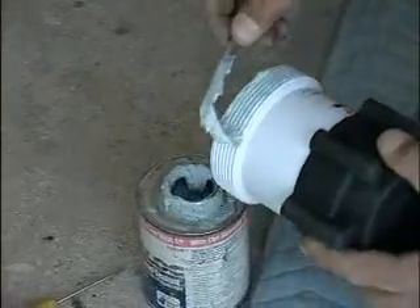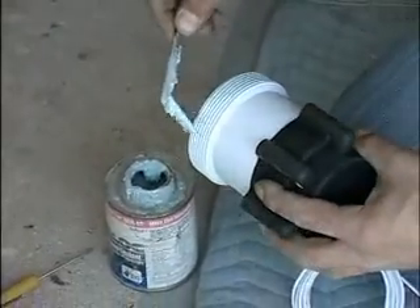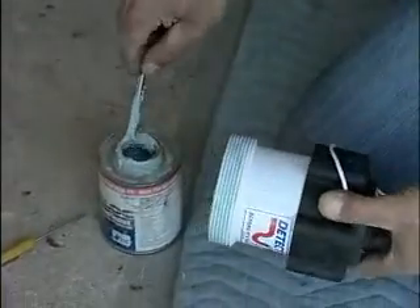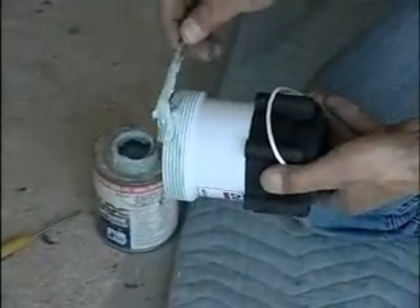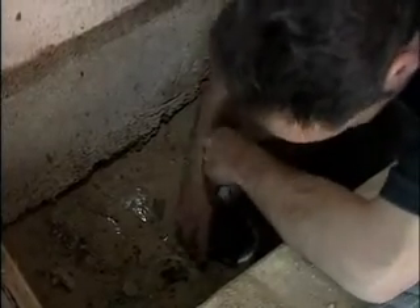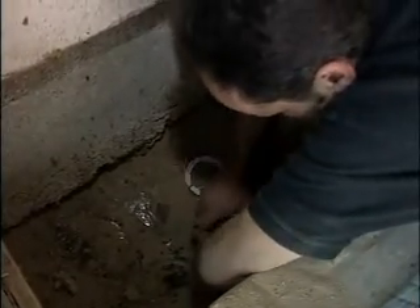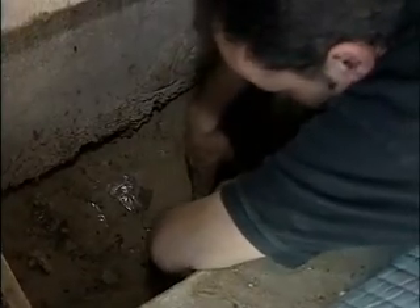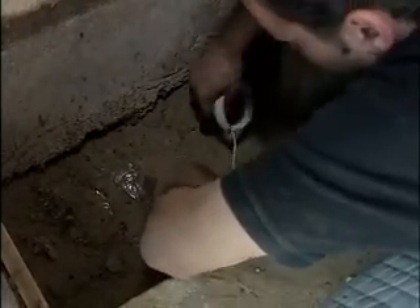What Danny is doing here is applying joint compound to the threads. Once it seals the threads inside the house trap, there's no back odors or leakage from any sewage water. Also, you don't have to worry about getting this sensor super tight — just make sure it's snug. There really is basically no pressure. Danny puts the rubber cap back on, then we're going to run the wire.